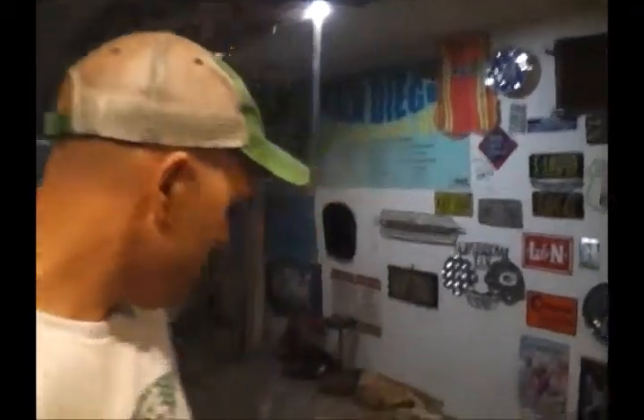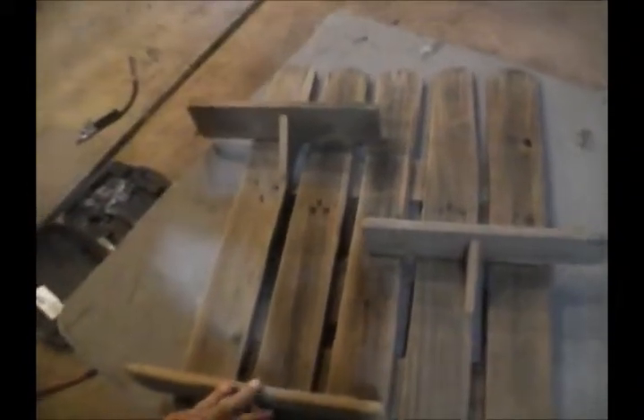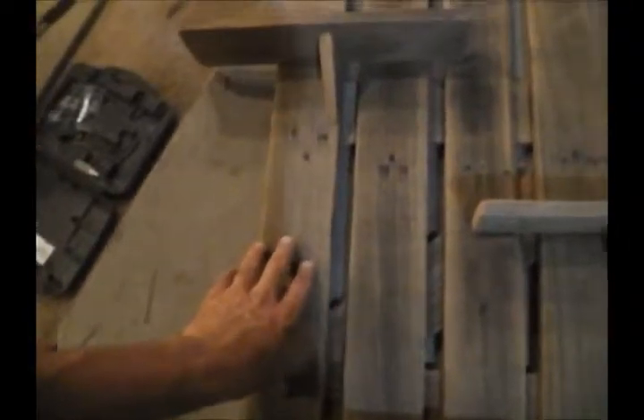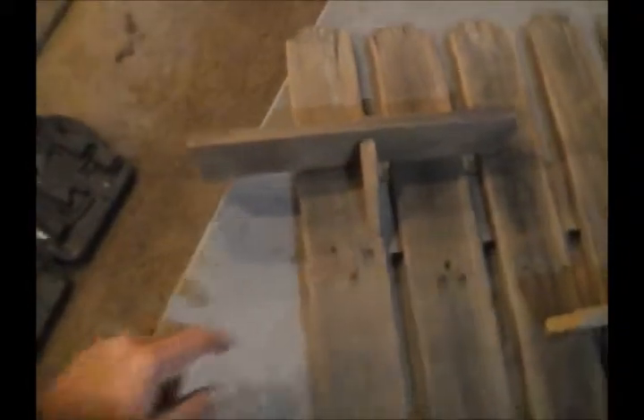We are done — here's the final product. What I ended up doing is using the tail pieces from when I trimmed and shortened the height of the gate. I sanded them down real good — no splinters. I had to sand the whole material down and lost a little bit of the patina, but it was very coarse and rough and I was worried about splinters. You can still see the dark spots, the veins, the nail marks, and even a knothole. After gluing the back and brad-nailing through it, the shelf was still a little flimsy, so I went ahead and built these gussets.